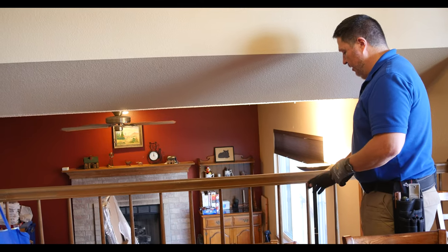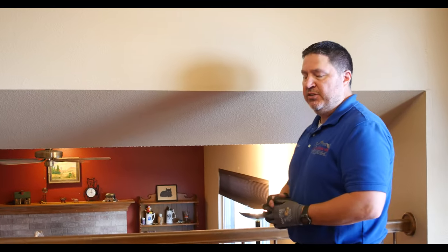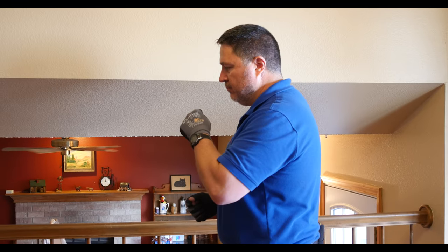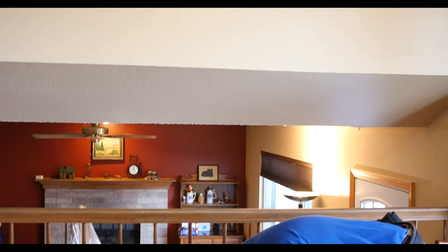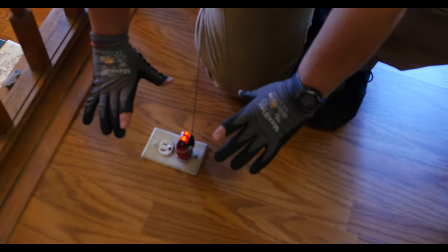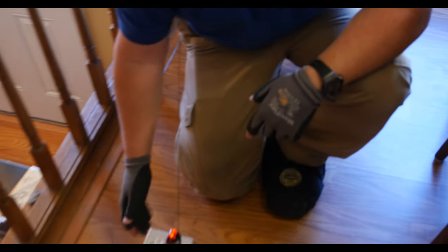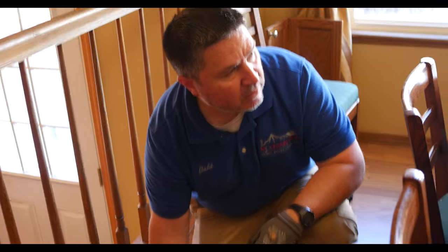There's a little vertical crack here — this juts out from the home and there's a main beam going up through here. It doesn't look like they've painted recently, so I'm not too worried about that; it's just part of where the drywall is. My hand is about four inches wide, so I know that if I can stick my hand through the spindles then that's too wide for our standards of practice. You can tell the client that when this home was built that wasn't necessarily the code in this area, but explain that it's to make sure kids and even adults don't get stuck in there — it has happened.